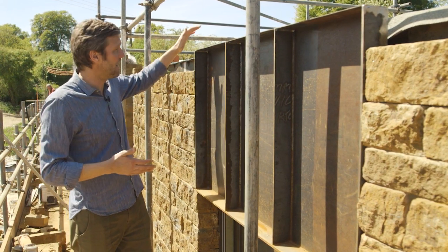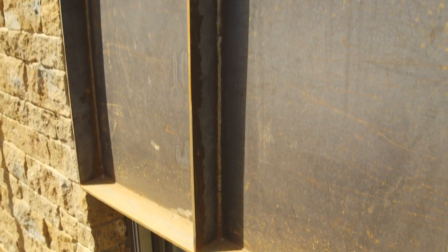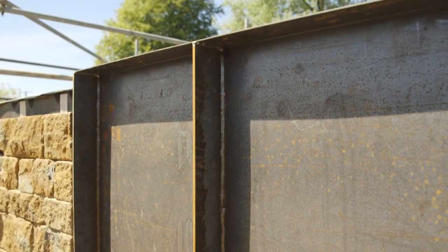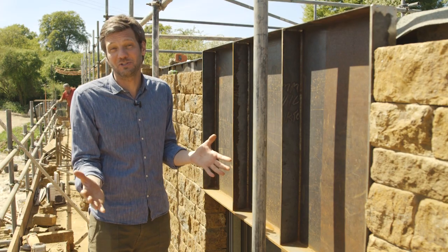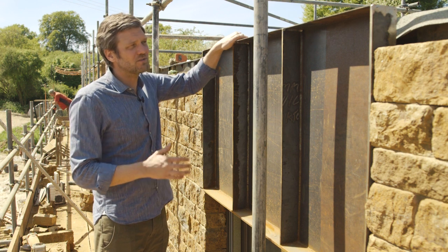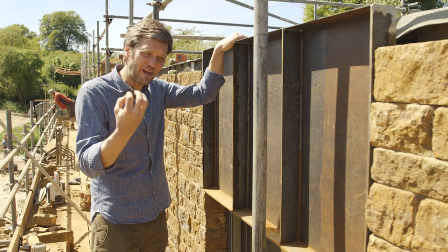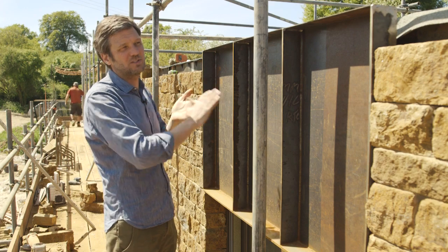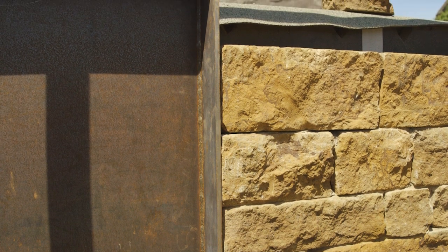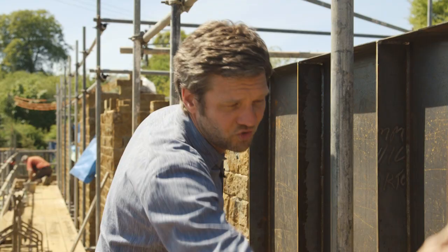This went on the week before last. The materials all came down on a pallet, pre-cut, and then we welded together working with Gary — we welded up this sample panel which actually went so smoothly it was hugely reassuring. There were concerns around the stiffness and springiness of the Cor-Ten and whether we could fold and bend it, which we could with the brake press that we've got, and there were concerns about how it would fit onto the wall with the fixing method I've devised using bits of timber and then bolts. To be honest, it couldn't have gone any smoother apart from having to trim back a couple of edges.